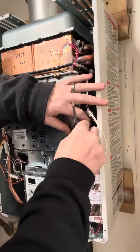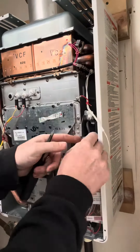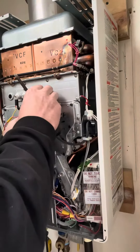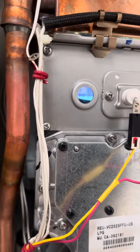Put it back on the bracket. Am I going to be able to take a shower tonight? I've got to go to the bathroom. Can I flush the toilet? Yes, you can flush the toilet. Now, this part is just plug and play. You've got the Molex connection goes on there, and then you're going to plug in the igniter. There's a little sleeve that goes over the top of that — don't forget it. I'm not really sure what the consequences will be if you do, but anyway, now you've got hot water.